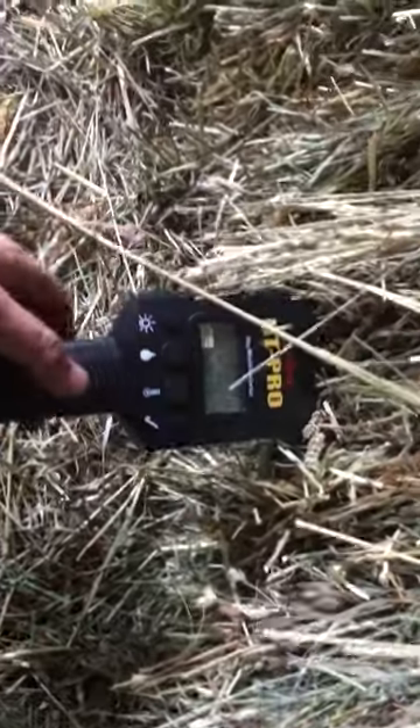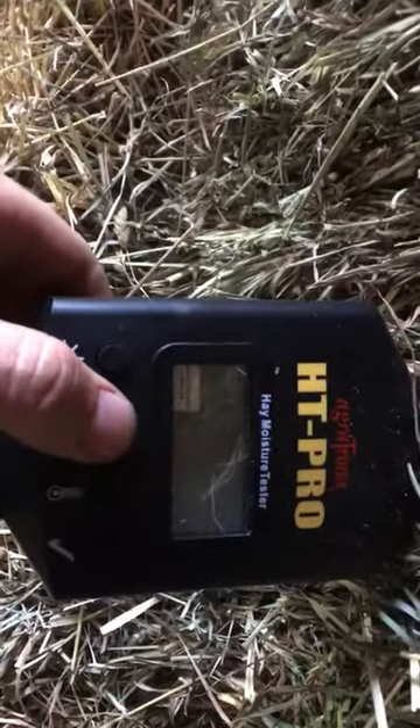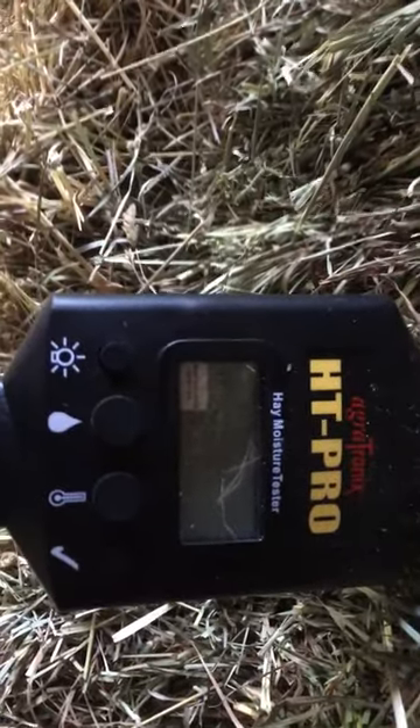Try another spot. There's one here that tested real high; I was wondering what was going on — 14.7%. This one: 18.2%. Yeah, this one I thought was a little bit wet that I set aside — 18.2%. There was a spot in here; this was around the edge of the field.